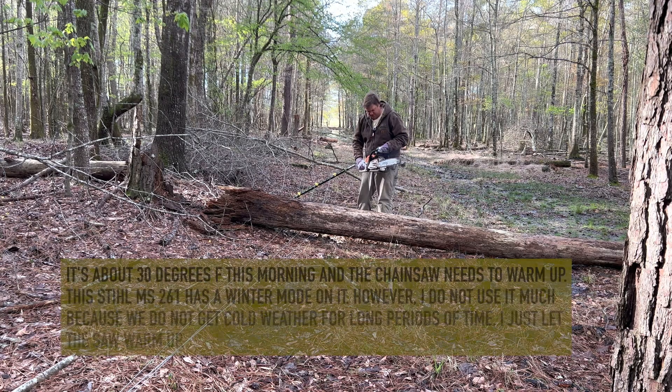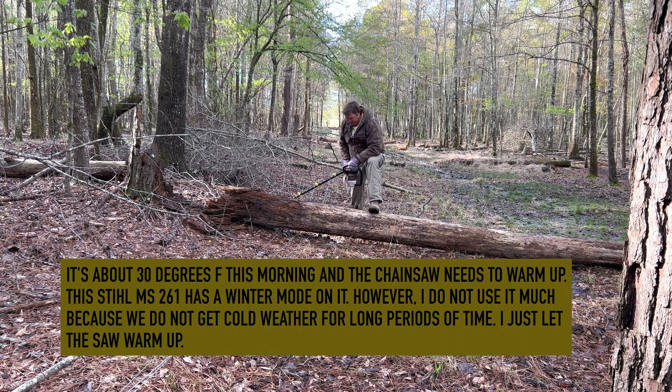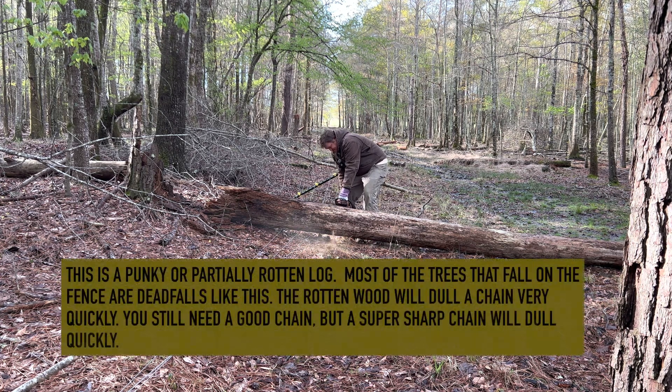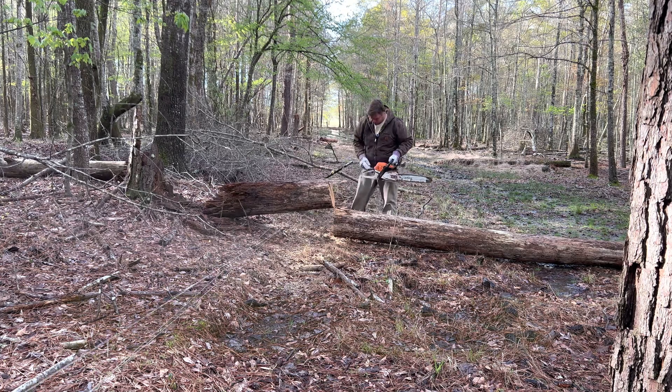You can remove stuff like this with the fence on — the fence is on at the moment. Usually we don't have to remove it unless the insulators are broken. This one is broken and the fence is shorting out on the T-post there, so I am going to have to turn the fence off to fix that part. Once I do that we'll come back and check the voltage.